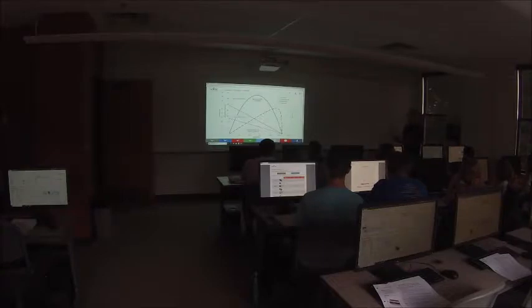We're assuming that friction is going to get us down because of the belts and the things. There's enough friction to slow the motor down. We're not going to be running at the freeload speed of the motor. That brings us down somewhere in this range, which is a good range to be because that's where we're hitting peak efficiency anyways.